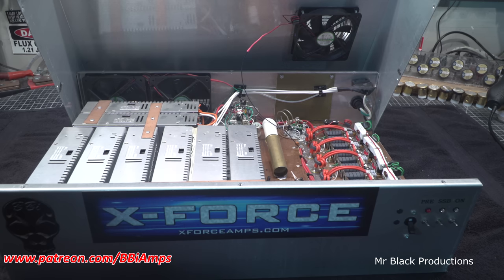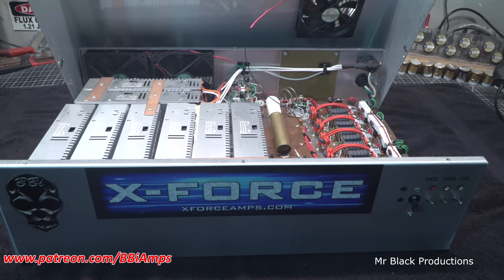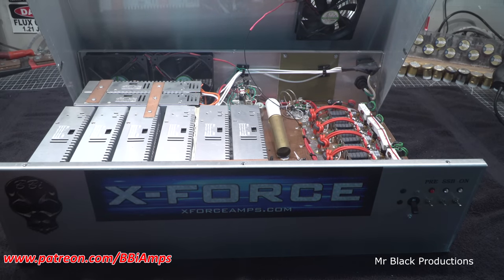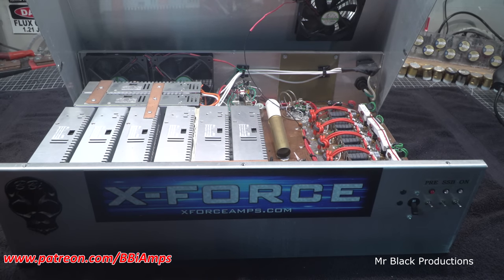This is in part of the interim crossover phase between the gray label, and what I mean by gray label is when Carl and Carol owned it, to the blue label, which is when Arlen bought the business. This is an Arlen built box. If I'm not mistaken, this was sold to this guy, and the reason it popped in the first place was because of a bad heat sink, not enough of it. Towards the end, it seemed like they were just cramming any bit of aluminum they could underneath it and called it a heat sink, even though it wasn't big enough.